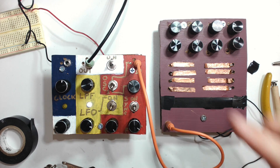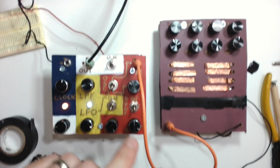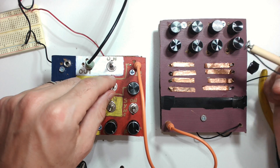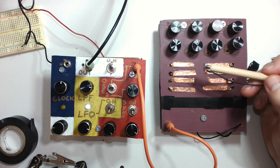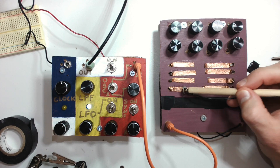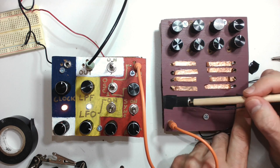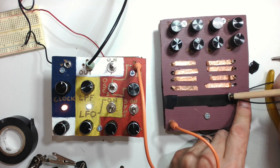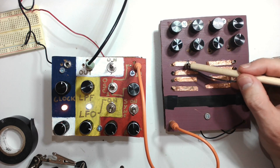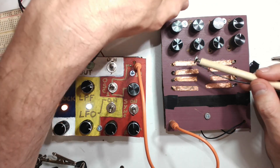Back on oscillator one, there's an OHM out jack right here, so you can patch in different resistances in place of the potentiometer. If you flip that switch, it'll be controlled by this stylophone that I built over here, which has a piece of VHS tape as a slider. You can pick whatever pitch you want.